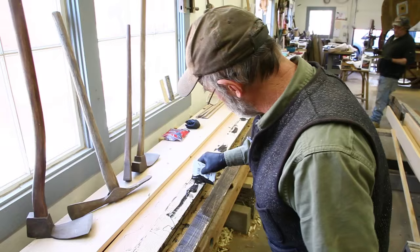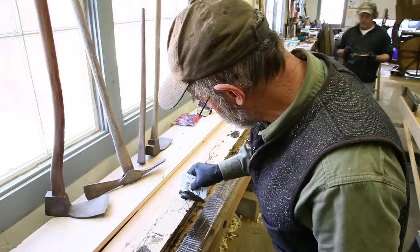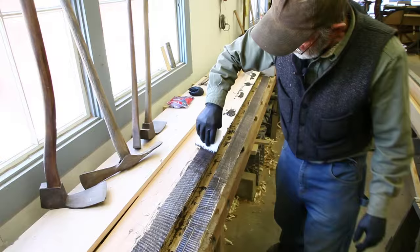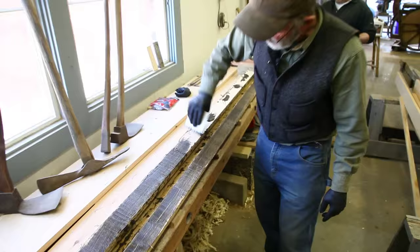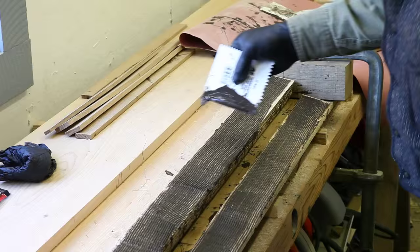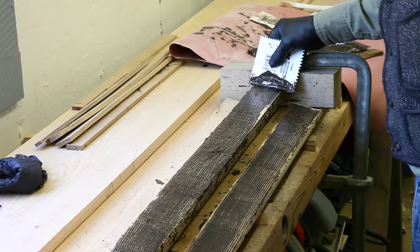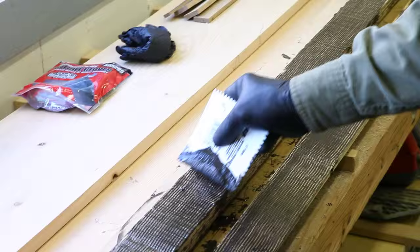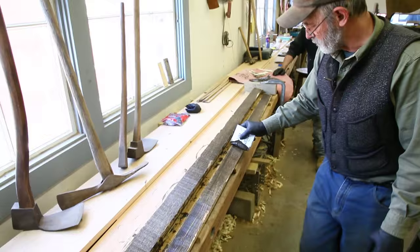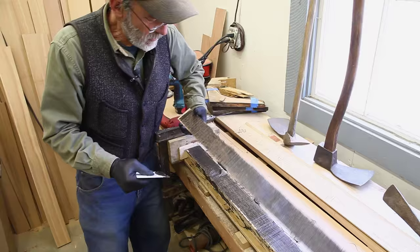We've spread the glue on the laminate pile and now we're going to add the last pieces — the foundation piece up against the heel, and the piece opposite to that from when we cut it, which makes the finished piece on the inside. I'm standing with a reservoir in front of the trowel, but once I've done it like that there's an awful lot of glue on there — too much. So I put the trowel down at an angle and scoop it along from one end to the other, and look how much extra glue comes off. That completes the spreading.